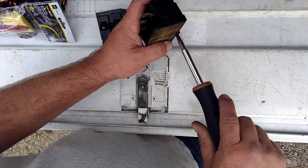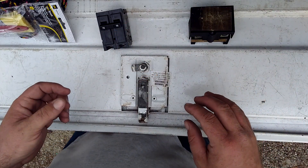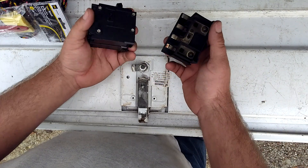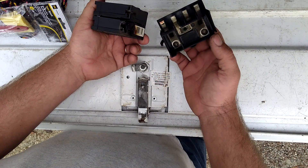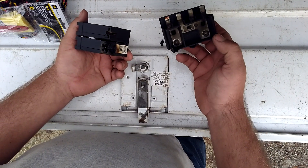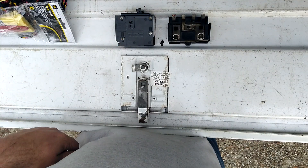I had a contactor instead of a sequencer, and it's a little bit different. I had to wire in the door switch, which turns the blower from auto to on as well. So maybe we'll get some more footage of that. But I just wanted to show you a few typical electrical failures — I've seen this one over and over again: distribution box, the breakers inside, burned off wires. It's one of the number one things you're going to be looking for with an electric furnace.